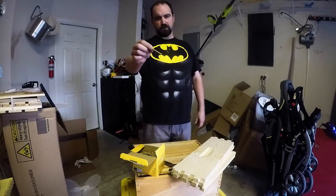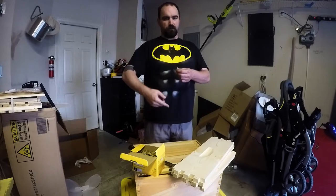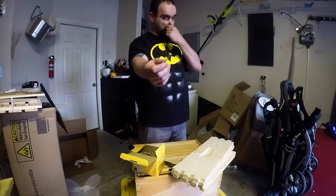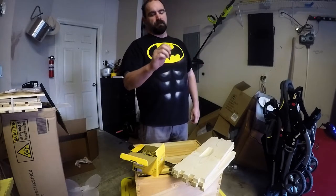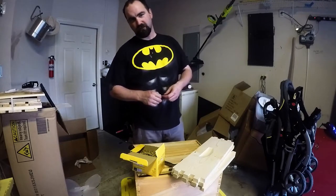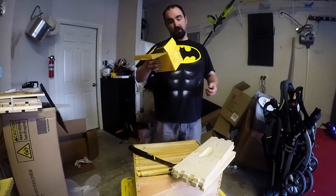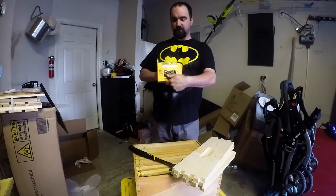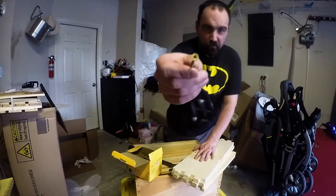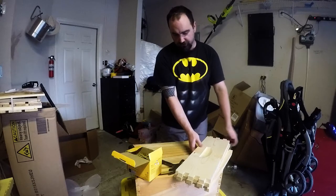So we have some 2-inch screws. These are deck screws, coated, so they're not going to leave terrible smears and streaks down the front of your hive. If you don't get coated screws or galvanized nails, you're going to have a bad time because they will leave rust streaks down the front of your beautiful paint job or just all over your hive, and it's not really pretty. So this is what I use. I'm not sponsored by these guys, but I'm using Deckmates number 8 2-inch, and these have the T25 star heads. Super great. You don't strip hardly at all. So anyway, let's get down to it.